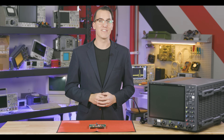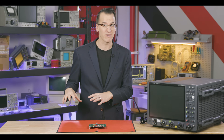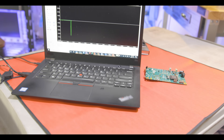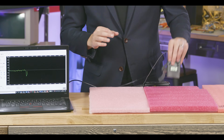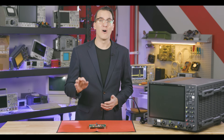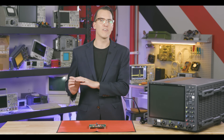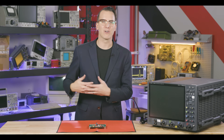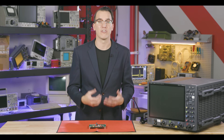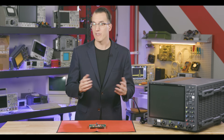Tip three for blowing up your test gear is to use an insulated or high-resistance material as a platform for your interface boards and devices. It's not just big carts like this either — all kinds of high-resistance materials build up an electrostatic field. Using our handy electrostatic field meter, we can see that this material charges up to over a kV. You don't want that going into your test gear. To avoid this damage, keep charged materials at least a foot away from your boards and use appropriate materials. If you're transporting boards, completely seal them in static shielding bags.